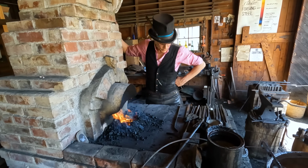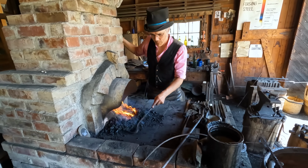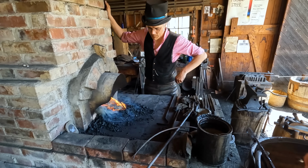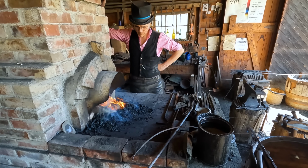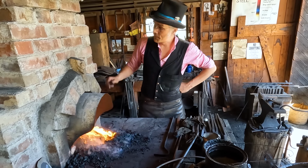There we go. The first process is hardening it. Now we're tempering it, but the combination of the two, hardening and tempering, gives it that perfect degree of toughness without getting it too brittle hard. And I have no idea the carbon content of this bolt, so.